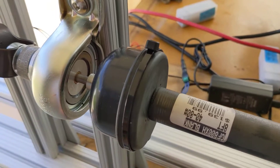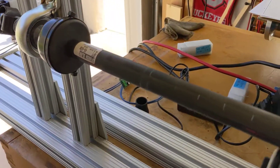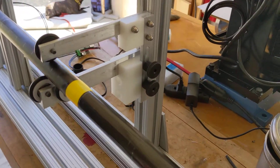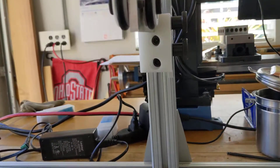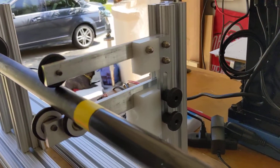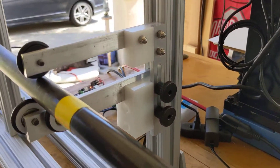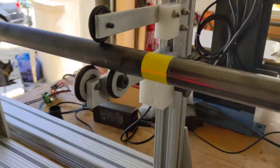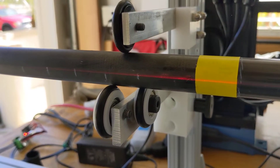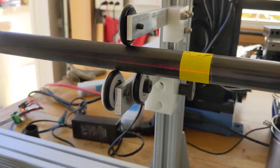Then this is a Flex-Coat self-centering chuck — those are sold by a gazillion places. Down the length of the stand I've got these adjustable support arms, which have a couple of socket head cap screws inside the block that allow you to adjust the height of the assembly. This hold-down arm has a couple of screws you loosen to move it up and down, or capture the rod as shown. The rollers are from Amazon — I think they were for 3D printers — a bag of 10 for $10, and I bought O-rings from McMaster-Carr that are the right size to fit them.